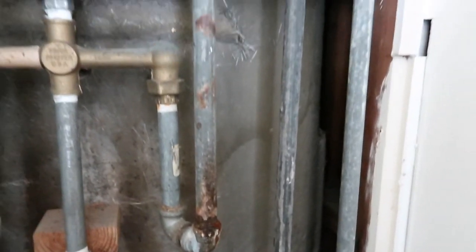Walking through the property — these hatches here, any time there's an easy-access hatch behind a tub, it's a great spot to look for plumbing leaks. I'm going to open this up. Instantly I start to see corrosion around the water pipes on the inside, and I can even see that it's wet beneath the tub.